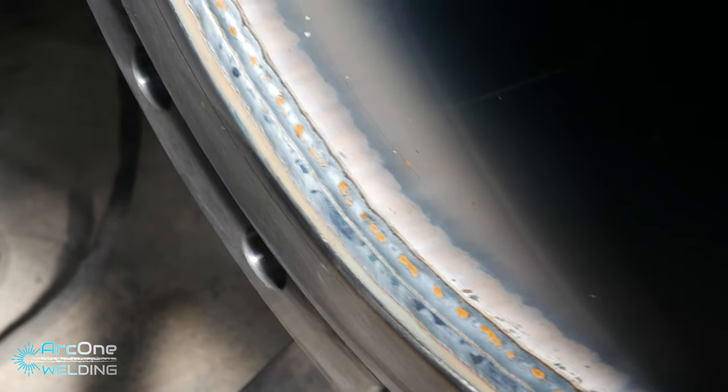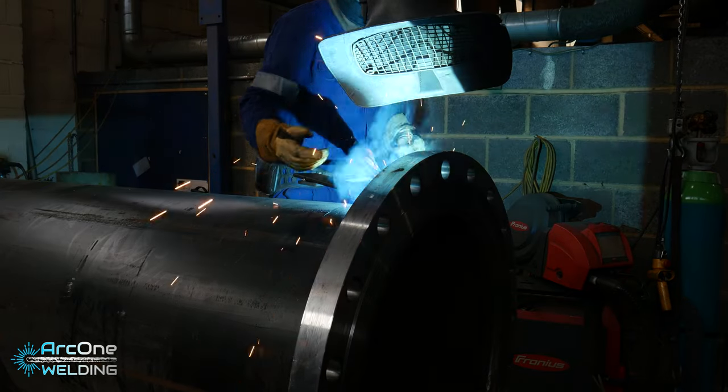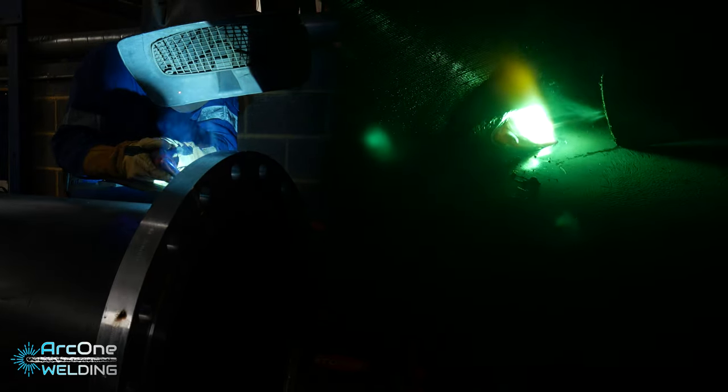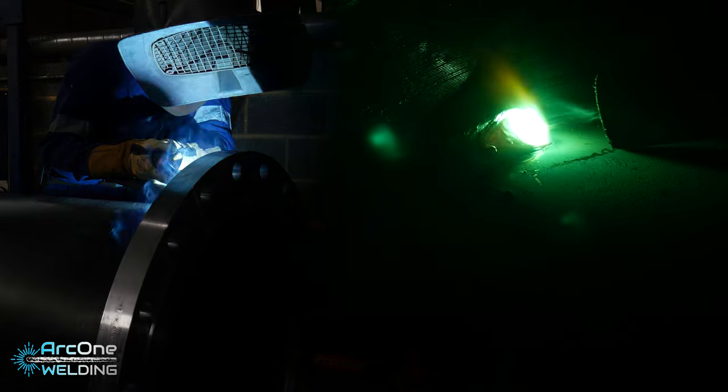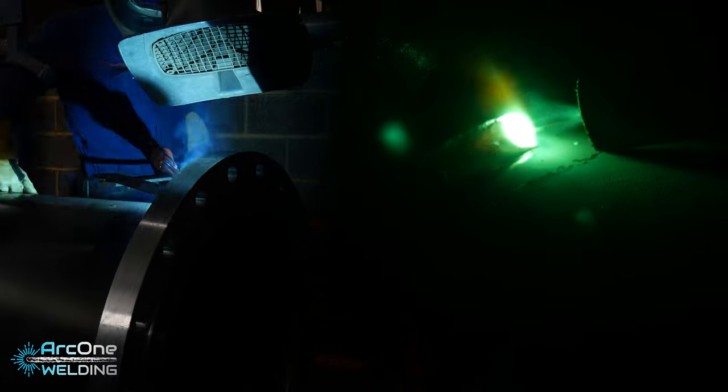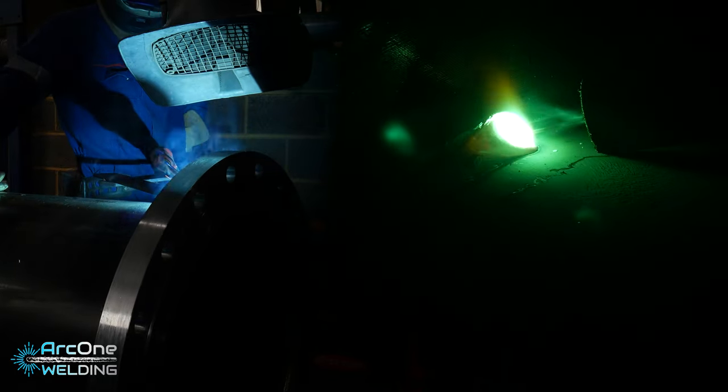If you watch certain videos from more popular welding YouTube channels like WeldTube and stuff like that, they've tested push and pull, and they found that there is almost no significant difference. So just bear that in mind. But in my case, I was dragging and pushing out of comfort, for example, or because the weld is thicker when you drag and it's more narrow when you push. So yeah, it was just preference really.